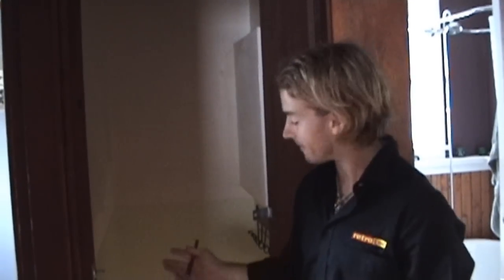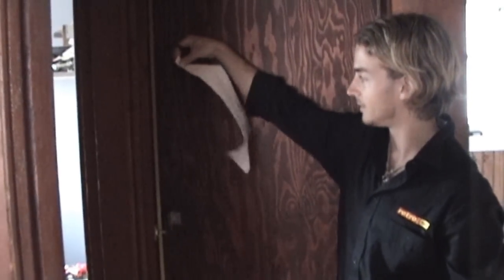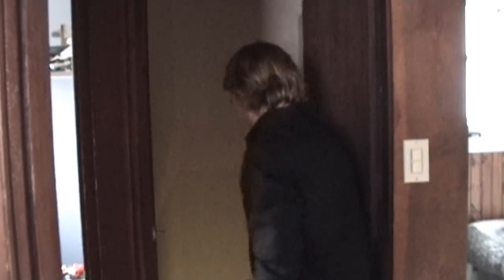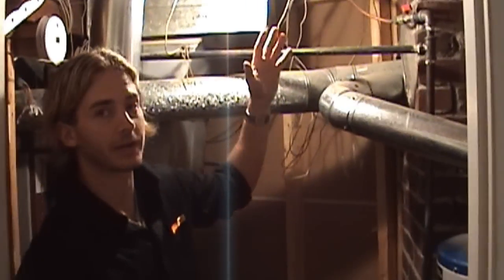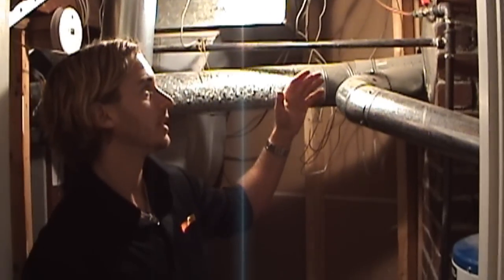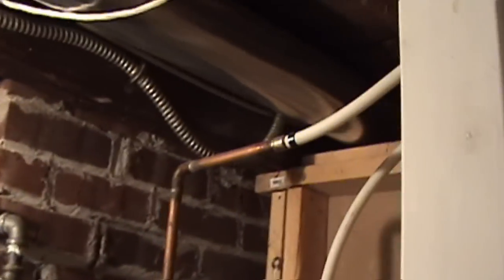People can find a lot of air leakage in basements. You can feel it coming up the stairwell, and I'm going to concentrate that air leakage by pulling the door shut just a little bit so you can feel it all coming through the crack. There are a lot of spider webs in this home, and as you can see up here in the basement, all the spider webs are moving around under the pressure — you can see the air moving straight in between the joists out to the side of the house.